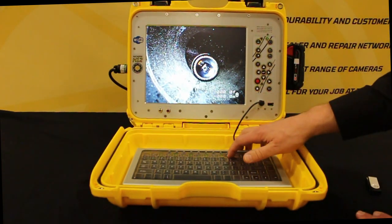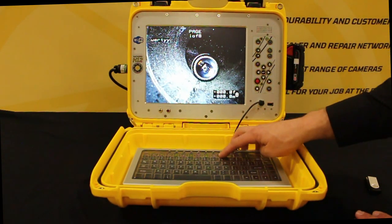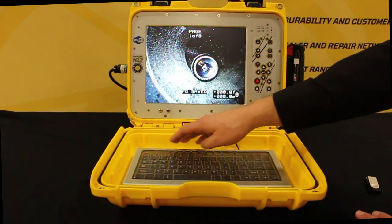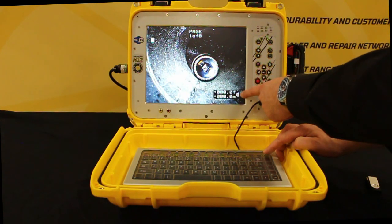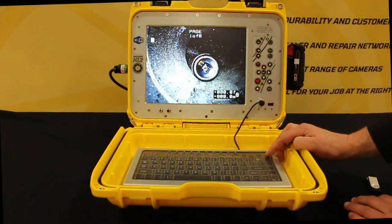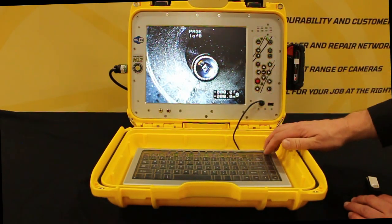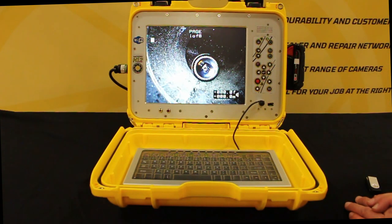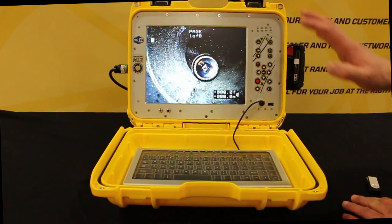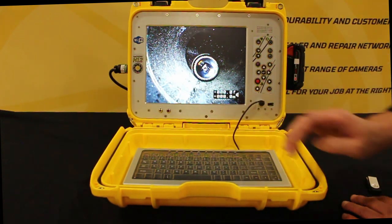You can choose to have white text instead of black text. The mic and speaker button toggles the mic and speaker icon — it's a binary function, so when the microphone is on the speaker is off. Playing videos with the microphone on gives you no sound, and if the speaker is on it will not record any sound during a video. It's recommended to keep the speaker icon on so nothing said during inspection gets accidentally saved onto the USB drive.